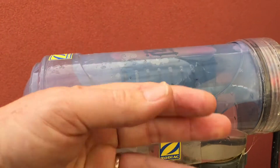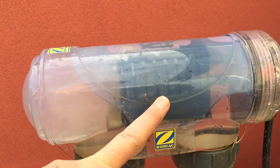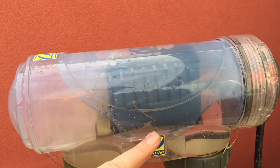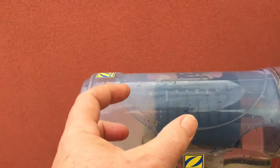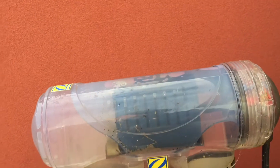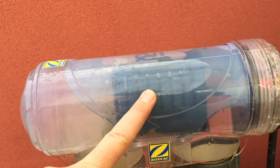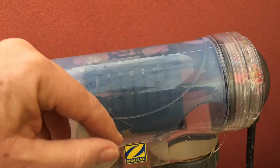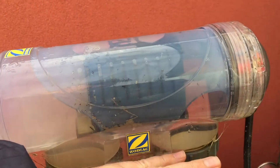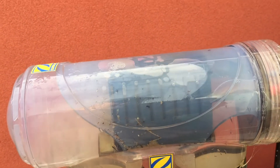These cells are very specifically designed so that there's always less than two liters of capacity, because when hydrogen gas gets to two liters it becomes quite volatile — below that it's a lot more stable. The cell can be on the side with the plumbing coming down the other side, but the cell needs to be somewhere near the top so that in a no-flow situation it will pump itself dry — no more saltwater on the plates, no more gases produced, and it stops. Quite safe.